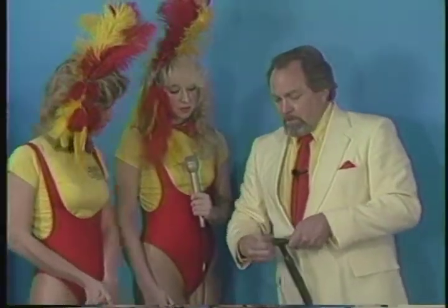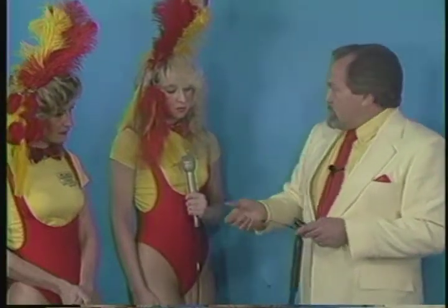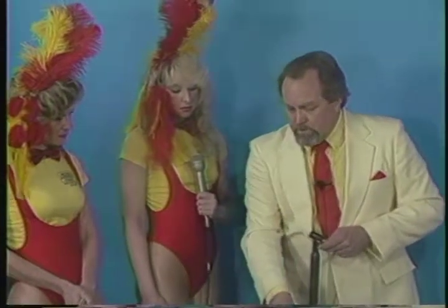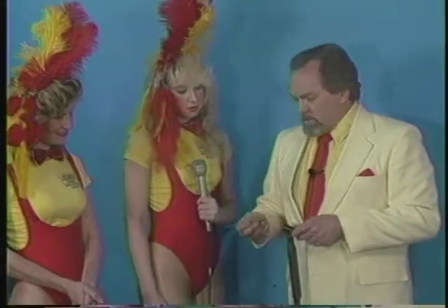The other thing is the electrode itself. This unscrews so that we can take the electrode out, and we're going to change it. In this case, we're going to put in the tungsten, but also this is for one specific size. Now we're taking the 2% out, and we're going to put the pure tungsten in. By the way, pure tungsten is always marked with green, and the other stuff is marked with red. And that just screws in.